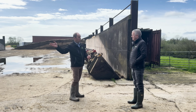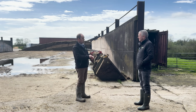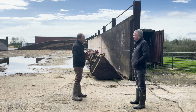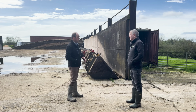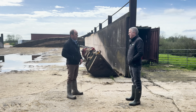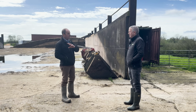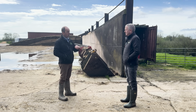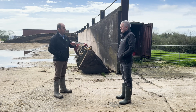And you will see, if you walk down the feed barriers on a gravel silage pit, you will see stones in the feed face. So ideally, if you can go for a limestone product. I know in Ireland it's gravel, that's traditionally what they can get hold of. And I understand that it's all to do with local supply, but if you can, spec a limestone product. I also like that in a parlour, and a cubicle building, a limestone, especially on sand bedding, you can wear at the same level.